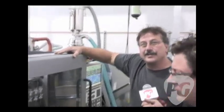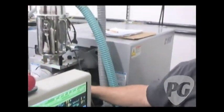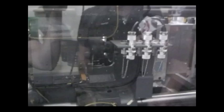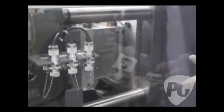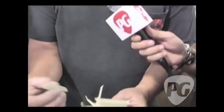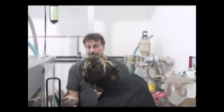I don't know what this is, but it's definitely impressive. This is an injection molding machine. We have plastic in the form of pellets, and it's brought into this machine, heated and melted, put into pressure, and squirted into the mold — it literally squirts it in like a liquid. And this is the part that comes out of this mold right here. This is the H bobbin, which goes inside our H cap pickups — like the 81s and the 85s. This is where they wind the coils up on this.